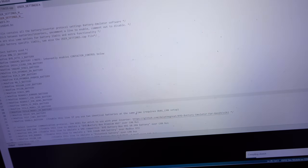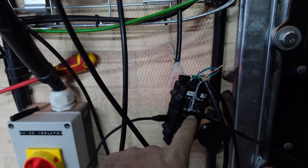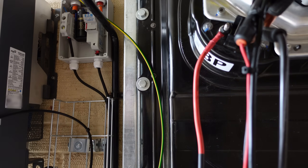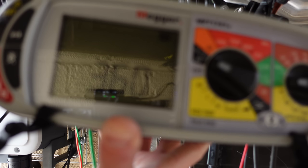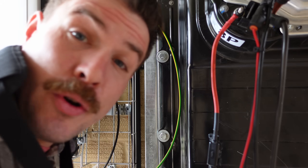I'm currently redoing the files on the laptop because they don't seem to be communicating. I've got my USB cable. I did upload to this one first, which is connected to the battery, and it went green — I've got a green light, so that's good news. It could just be that I've switched them around. I'm going to be probing across the outputs here with this meter and we'll see what we get. And there we're seeing it — we're getting an output from the battery.